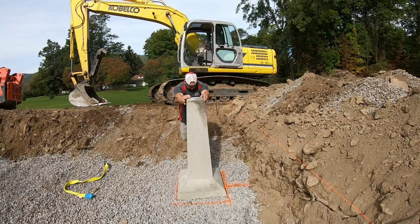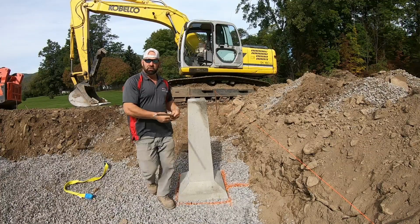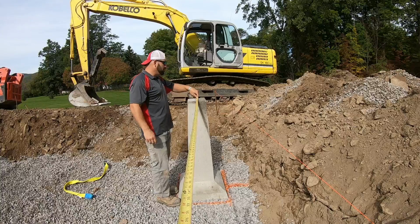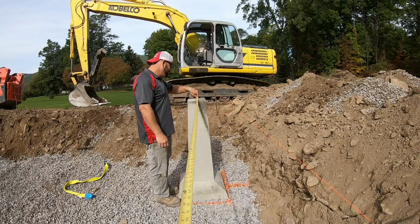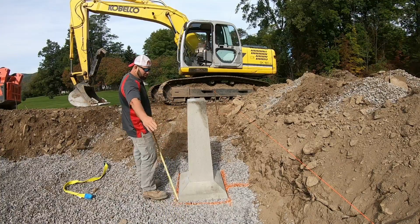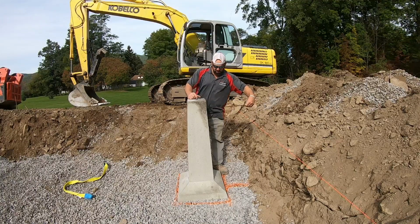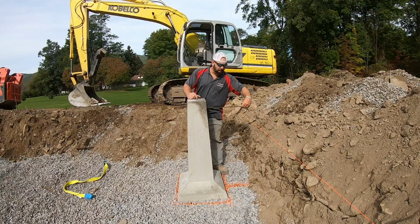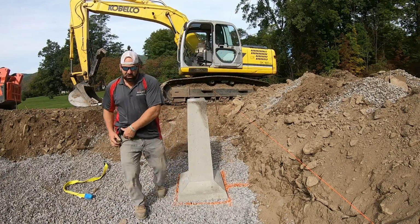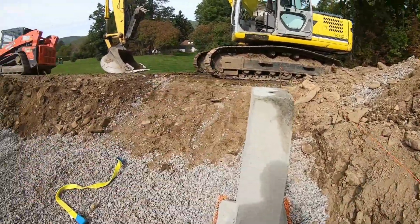All I do is do this. Put your foot on the bottom, rock the top, and walk it like you're catwalking. And wow, dead nuts, dead nuts. That line's off because I pushed the stone, obviously. Then we just got to go 12 to this, and wow, perfect. That one's set. So we got all 4 set. All 4 piers are set right now.